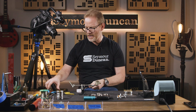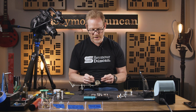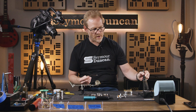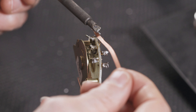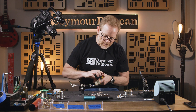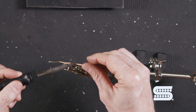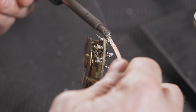Here's an old switch — a good one to practice cleaning off solder. I'll clip off a little bit of braid and get this braid to work. I'll flow that braid across it — that did a nice job of opening up that terminal. This next one feels like it's got some wire stuck in it. Sometimes you get wire and all this gunk in the terminal, so it's good practice to get in there fast, clean it up without overheating it.